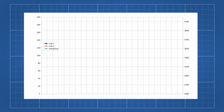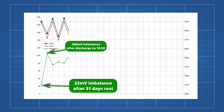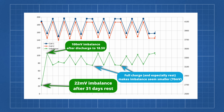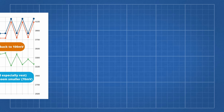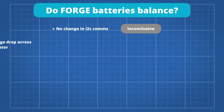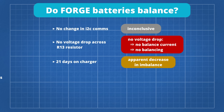I decided to discharge the battery to 18.5V and straight away we see the voltage difference is back to around 0.1V. I then put it through another 11 charge and discharge cycles and saw the same pattern. At full charge, and especially after rest, the cells seem closer together, but discharging to around halfway reveals the true imbalance. So after leaving the battery on the charger for 21 days and doing a dozen or so charge and discharge cycles, there has been no improvement to the balance of the battery.